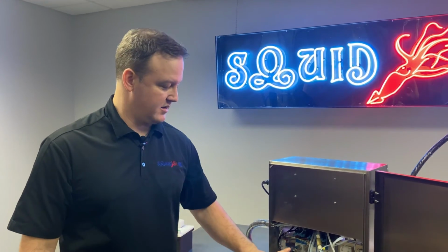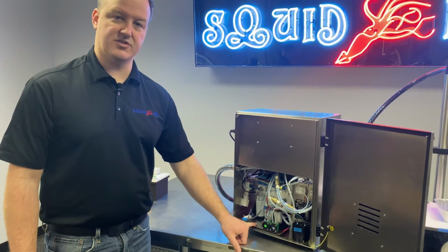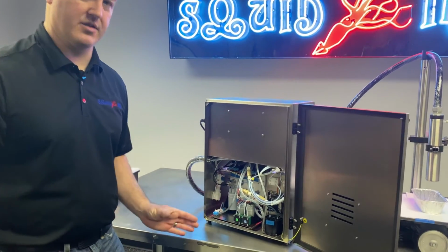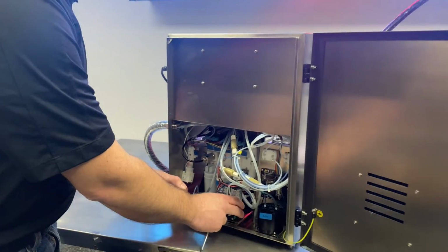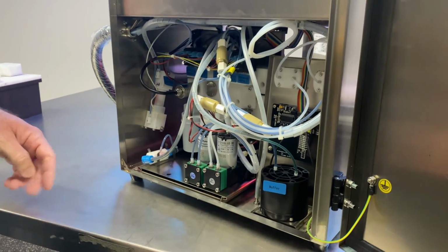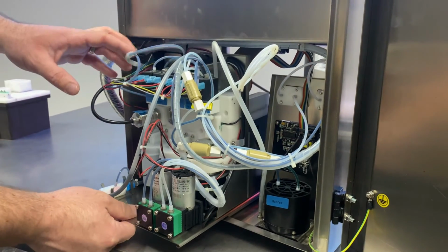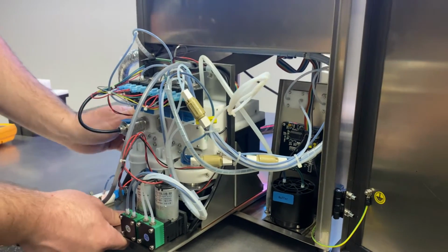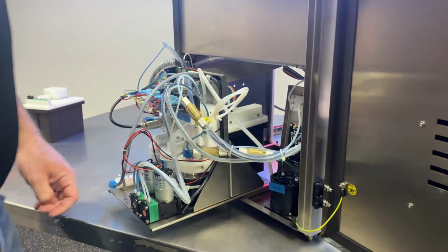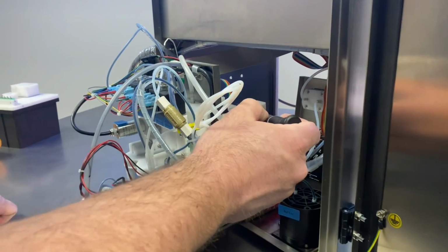All right, we're at the back of the machine. We're powered off. The screws are out for our tray that the hydraulic assembly sits on. So now we can actually slide this out the back of the printer. And really the only reason we need to do this is to get at the screws on the level detection assembly cap. When you slide your assembly out, just keep an eye on your hydraulic lines and ribbon cables. Make sure nothing gets caught. But really we just need it to this point, so we can access these two screws right here.